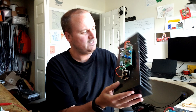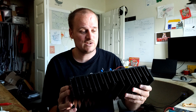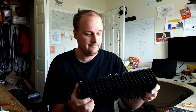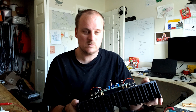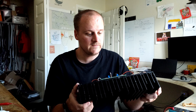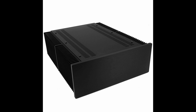We've got two fully working channels of the F5 using the Jim's Audio boards. I really like these boards — they're small and things just worked 100%. Good job to Jim's Audio — highly recommend them, they're not expensive. Use your own parts; the BOM went real easy. I used Panasonic 3 watt resistors and everything else was Dale — my favorite precision 1% Dale resistors.